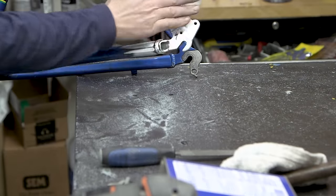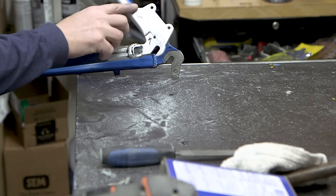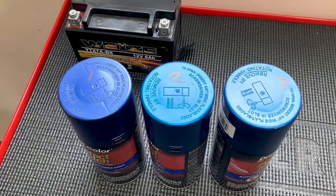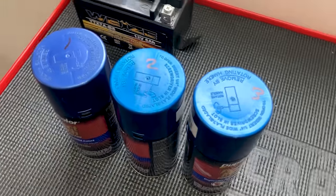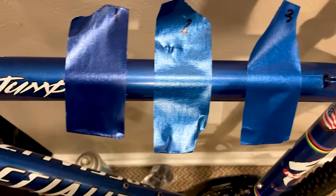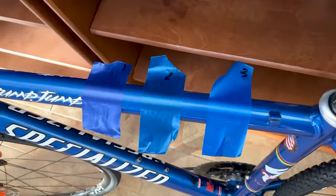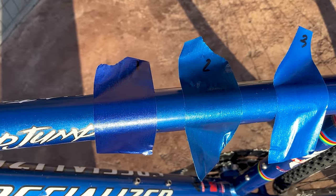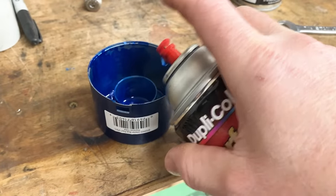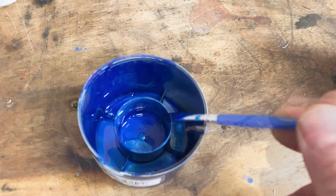The strength of this joint depends on how much contact it has between the frame and the mount — you want as much brazing material on there as you can get. To try and match the paint on this frame, I went to my local auto parts store and bought every can of blue they had — in this case, three cans. I sprayed a piece of masking tape with each, stuck it on the frame, checked it in various lighting conditions, and picked the one that looked the best. That was number three: a color called Intense Blue.